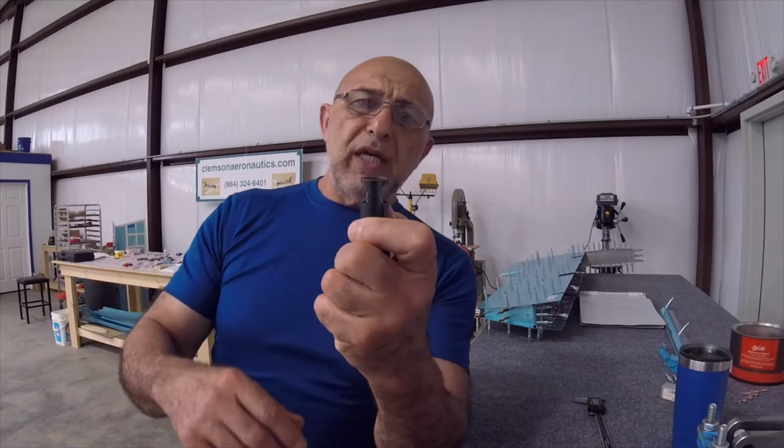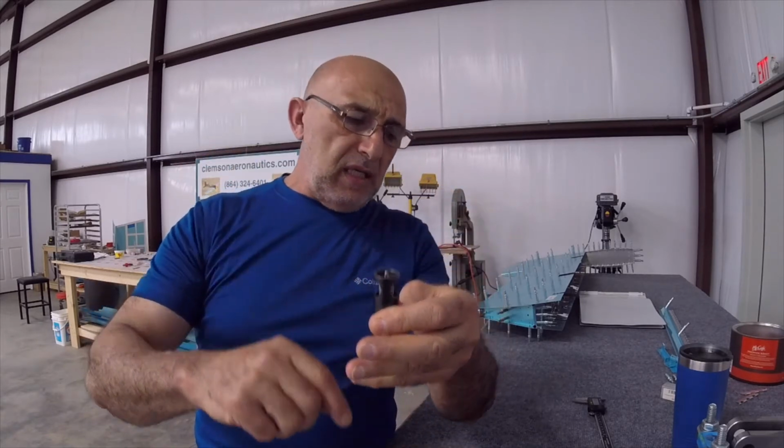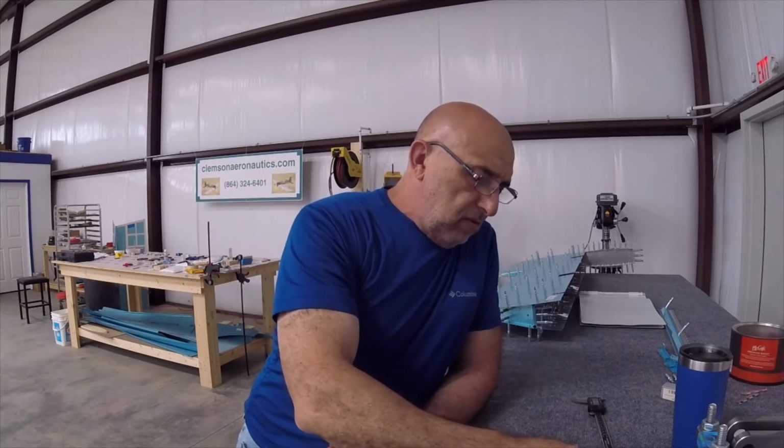He tried to get the rivet in after he primed it, and now the hole was too tight. He said, I don't want to push the rivet in there, and he was afraid about the thickness of the primer also, and he didn't want to go too deep on the countersink. So he took the cutting tool that is used for countersinking, put it in the hole and turned it, and he said that was to shave the primer. And then after that, the rivet went right in.